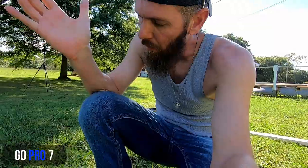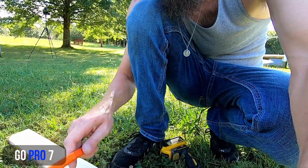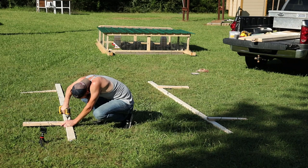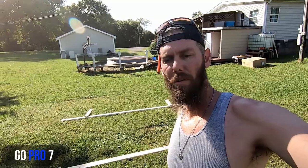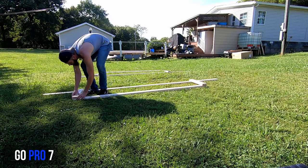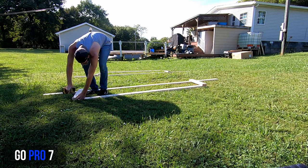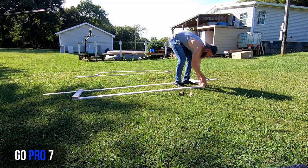To make everything line up well, stay on the left side of your line — so you pull it out two feet to this side of your line every time. That way you know you have eight feet from stud to stud. The distance between your two studs should be eight feet. Stand it up, lay your 8-footer full board down, get your sides lined up with your edges, and put in one screw only so you can still adjust.